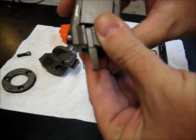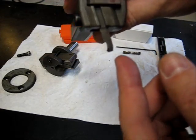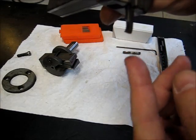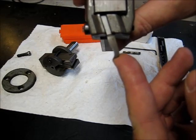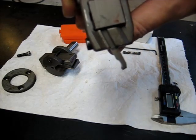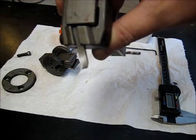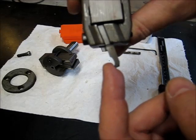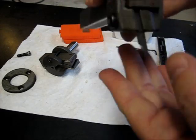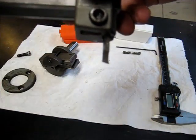see the orientation here. The ValCut cutters are a complex grind. Certainly wouldn't be something that I would want to try to reproduce by hand, even though I'm not saying someone with a tool cutter grinder certainly could do it, but this is the orientation as the cutter moves across the work. You see the cutting edge is drug across the work and cuts down into the work.